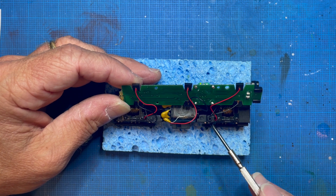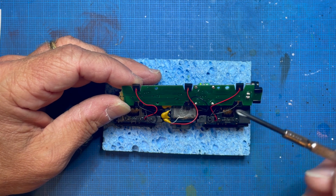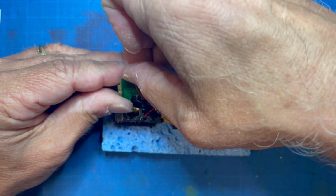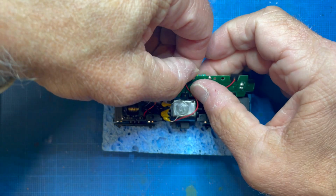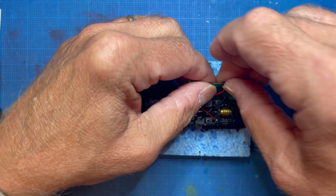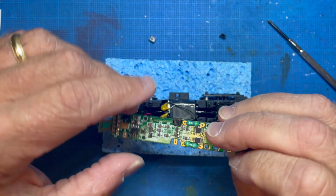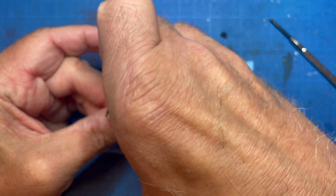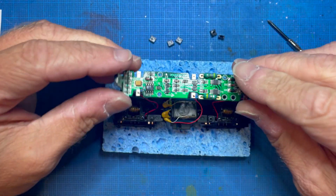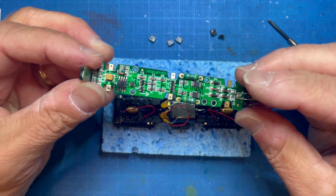So I'm not going to mark this train. I'm going to know that as soon as I remove just the board. We're going to use these wires to connect it to our new decoder. But we remove this PCB board by slipping these little black slotted things right off. If you saw, that one just flew right off and practically hit me in the face. But carefully pull these out. And this side too, there's 3 on each. Okay. And the wires typically pop right out of there once you remove that, because they're just through that hole, and there's your board removed, okay?